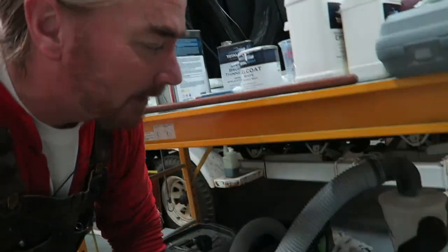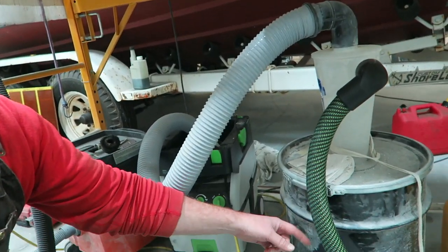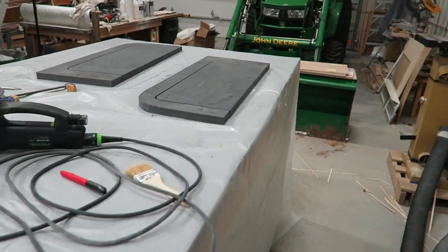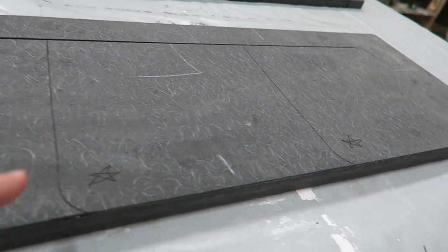I had a little bit of a whoopsie — not really with the routing, kind of. When I was going through and trimming everything off, I noticed that the vacuum wasn't sucking up much of the dust from the router. Last time I did this, I had almost zero dust get away on me. Come to find out, the vacuum system I use goes from the vacuum to what's called a dust deputy — a little cyclone separator. Well, when that thing is full — which it was, all the way up to the rim — there's very little airflow going through to the vacuum. So there just wasn't enough suction to pull the dust from the router. But overall, the trimming part of this went really, really well. I still have nice, good, even spacing all the way around between the frame and the actual lid.